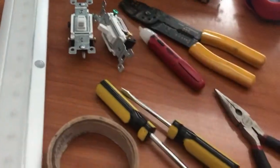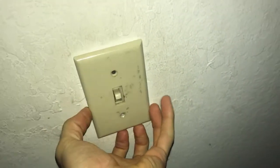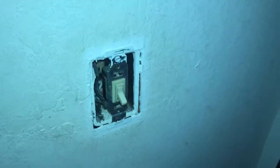With that out of the way, we're going to turn off the power to our wall and begin this job. For demonstration purposes, I've taken out the two flathead screws that hold in the faceplate. Something important to do before you go to your circuit breaker is first turn on the lights in the hallway so that when you flip the circuit breaker you'll visually see very quickly whether the circuit has been killed. I'll also use this opportunity to demonstrate how the voltage meter works — note how it beeps once when I press it, but when I hold it next to these live wires it beeps like crazy, indicating this is currently a live circuit.